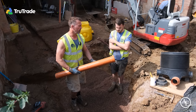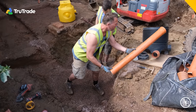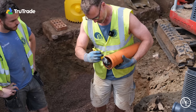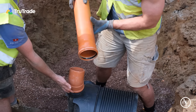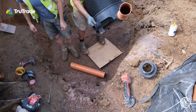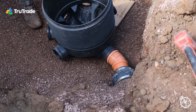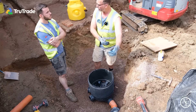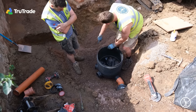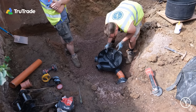What we're going to do, James, is we've got an off-cut pipe and we're going to cut this to 450mm, so I can just slip it into the salt glaze fitting there. When I put a fitting in, I don't just push it on - I always give it a bit of a twist. Look how easy that went. I'm going to slip that now into here and then push it onto the salt glaze. That plastic is 450mm and the salt glaze run is 600mm. All I've got to do now is set that level and then tighten that up. I know my run is going over that way.